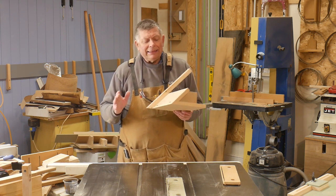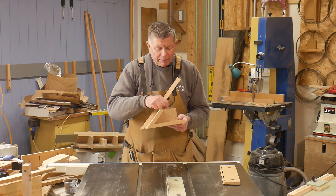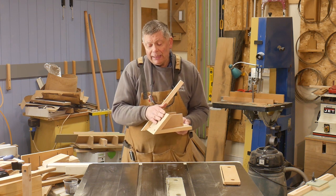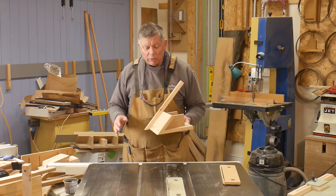When I glued it together, I didn't try to glue all four pieces at the same time. I glued the fillets in first, and only when I'd got them right and they'd gone off a bit did I glue the face in place. That saves having to try and clamp multiple pieces together at any one time.